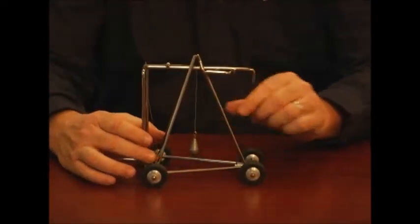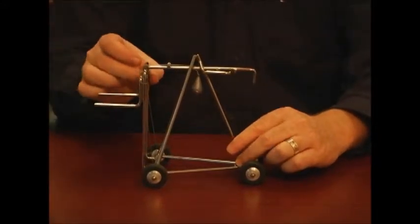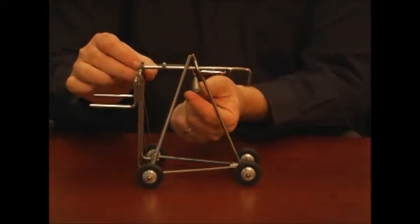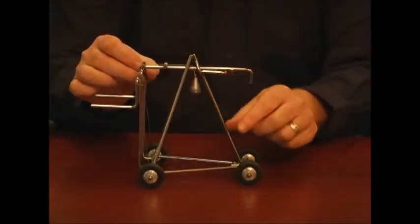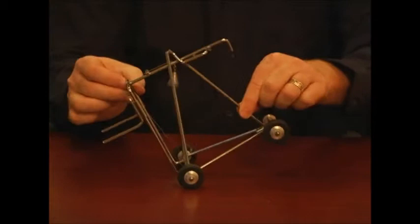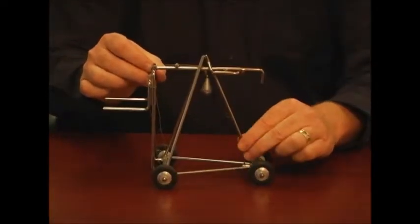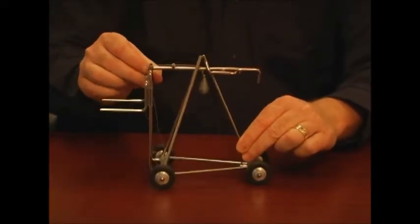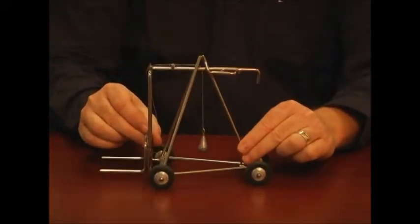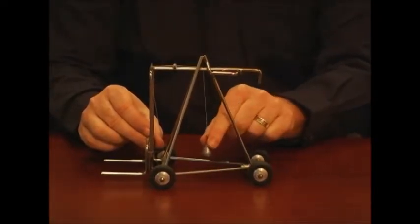Now, down here the truck is stable, but as we lift the forks, you can clearly teach them that there's very little room now for this center of gravity to travel, because if it were to come out, for example, if he's driving along and he stops quickly, the truck will tip forward. Or if he's got the load lifted up high and he turns quickly, it could cause the truck to tip over. So that's why you should always travel with your forks down low, because you have more room for your center of gravity to move.